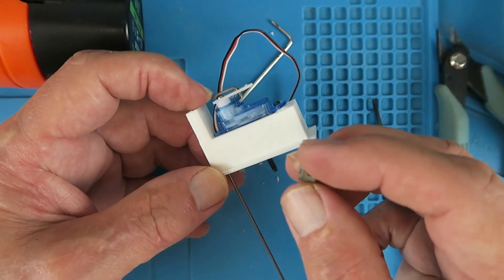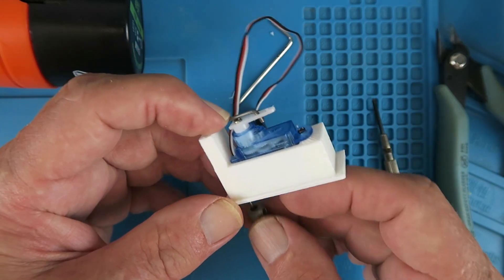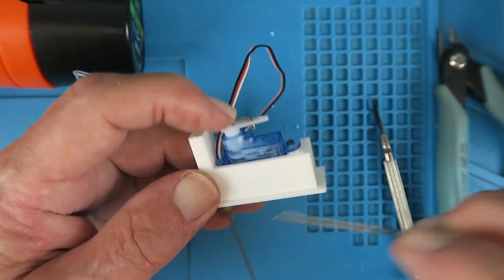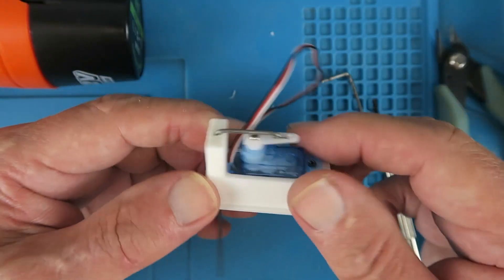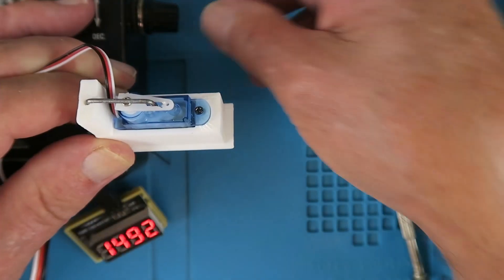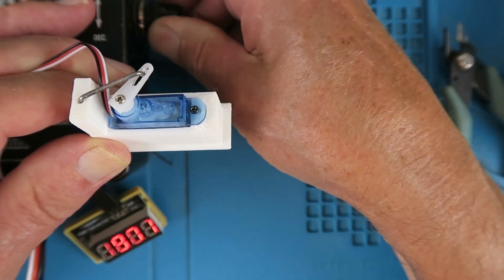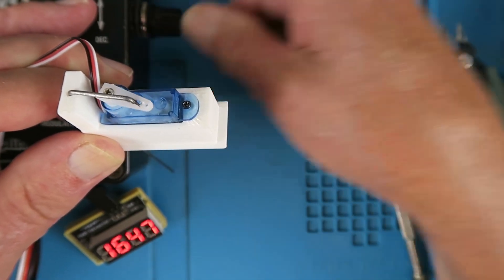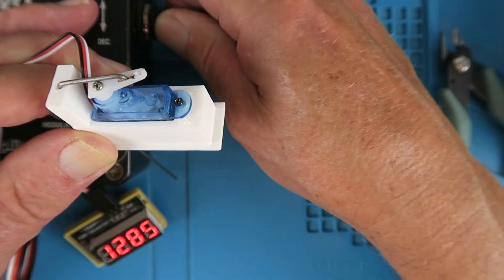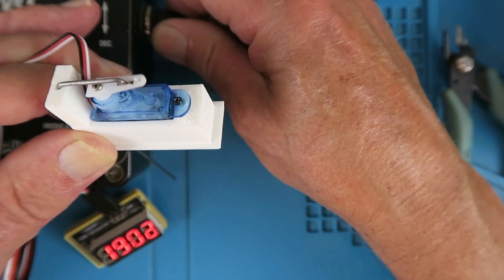I have a rather oversized collet but it's the only one I could find, and that will simply place over the bottom there. Once that's tightened up, that's not going to go anywhere. A quick check now with my ancient servo tester — it's not binding. There's enough space for it to move in both directions without binding up.